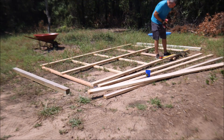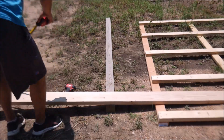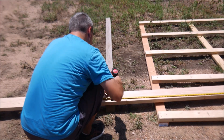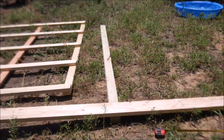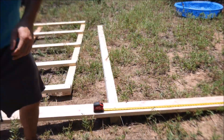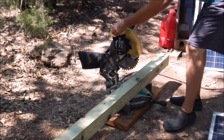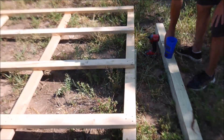My basic design is a 12-foot by 8-foot rack made from 2x4s that will pivot in the center to allow for adjustment of the angle relative to the sun. I'll use heavy-duty 4x4 posts in the center to support the rack and allow for rotation. At the ground level, I'll have a frame of 2x4s and 2x6s that the wheels will mount to, with support braces for the main 4x4 posts. I'm certainly no engineer, but I've built enough contraptions out of wood to have a basic idea of what forces this mount system will encounter. It'll be pretty heavy, but the one I'm worried about is wind — solar panels are like sails when mounted on a pole or ground mount system, so I'm going to do the best I can to brace this thing, but I'm sure there will be things I overlook or underestimate.